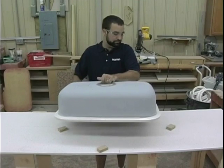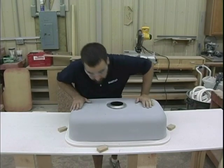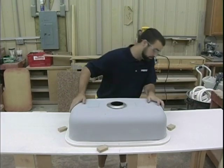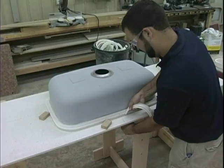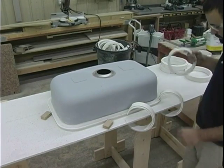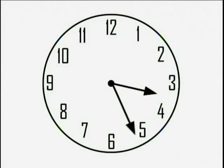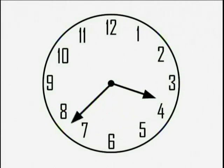Place the sink into the correct position on the back of the solid surface. Clamp the sink securely using your preferred clamping method. Allow adhesive to cure completely, approximately 30 to 40 minutes depending on the brand of adhesive and the climate.